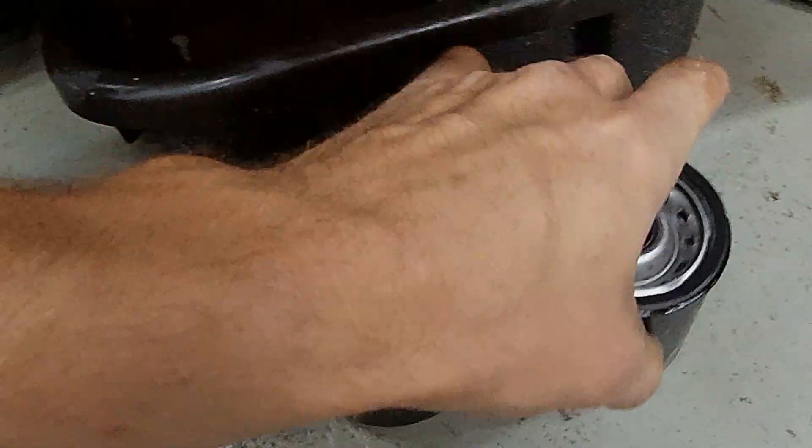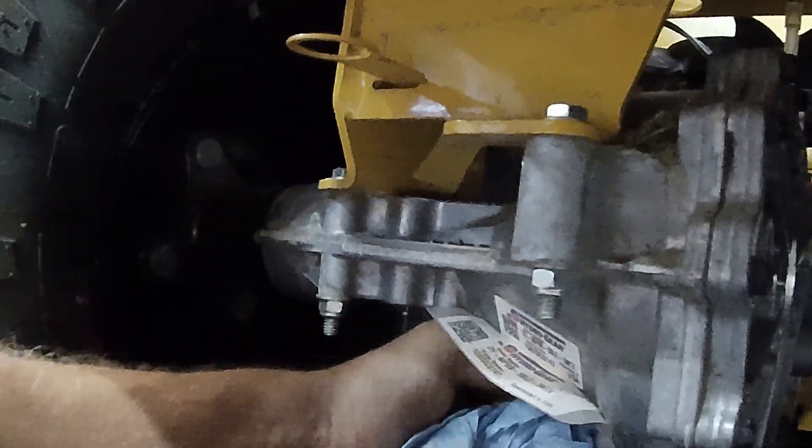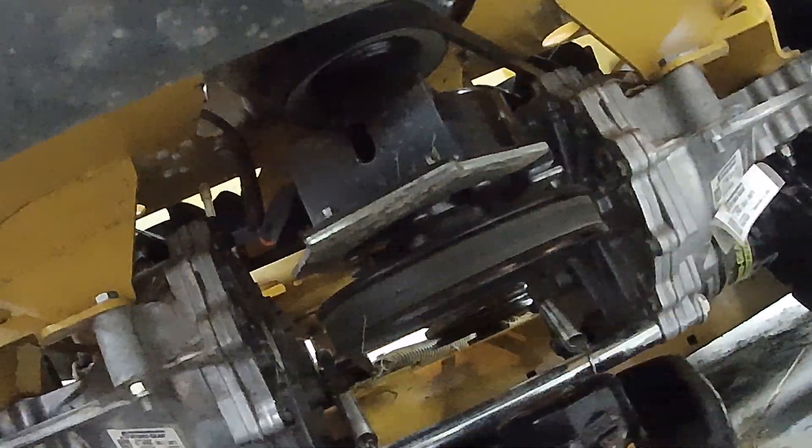Now that we've lubricated the new seals, we're going to come in here and quickly give this flange a wipe, make sure it's pretty clean — which as a brand new mower it sure should be. We're going to go ahead and screw this filter on tight enough. Remember, it's like a motor oil filter. And if you're going to service your zero turn in the future, consider not tightening the ever-loving crap out of these like the OE did, because it does make servicing this a pain.